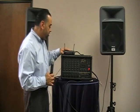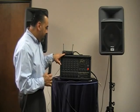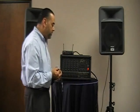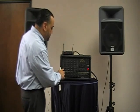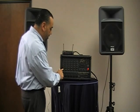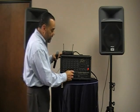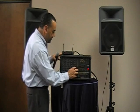There's no on and off switch, and you know that because you see the numbers on the front of the unit. And now we're going to plug in the mic cord, which has one end plugged into the back of the base unit. Make sure your volumes are all the way down on channel one. We're going to plug that into channel one. We're going to raise our main volume up to about four. We can always adjust it later.